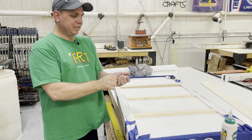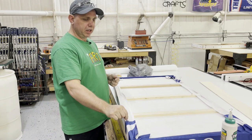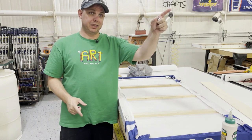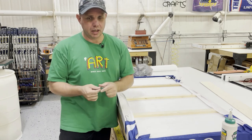Now it's time to put these on the ceiling. I have these hooks here that screw in. I have them in this already. Once again, the joists are 16 inches apart, so these are 32. So I had to measure on the ceiling and get all that stuff. It's kind of tedious, but wherever your joists are at, that's where you've got to do it.